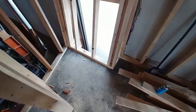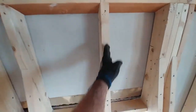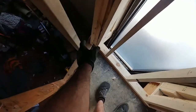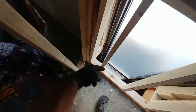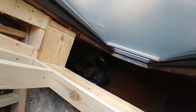And then we had this bump out for the window, which turned out real nice. I basically just framed the opening like I was saying, and then put a layout in here, on 16-inch centers. Where was it? I think starting on that side. Anyway, then there were cripples over this window opening, and I defined the opening as the largest possible notch on this aspect before it runs into the heavy beam that supports this loft up here. So the biggest possible notch, and then I pulled the string line from the inside corner here through and past that joist down there and snapped it. Actually, I snapped it 1 inch away from what I wanted there, and then I worked off it at 1 inch, but I could babysit the fact that it was at an angle.